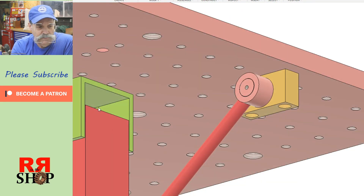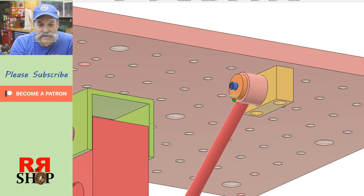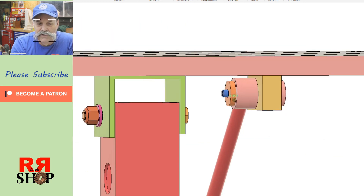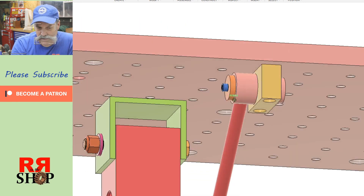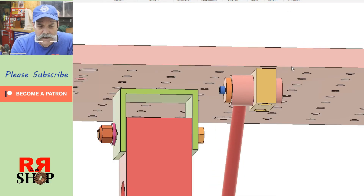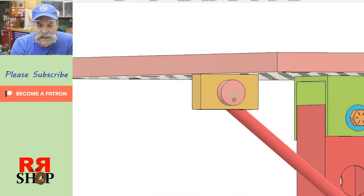Off camera — I'm not going to show making this — but this is just a washer with a quarter inch hole in it, and a socket head cap screw to hold that on. That would just stop this from slipping off the pin. I want a nice free fit here, no binding whatsoever. It has a little bit of wiggle room on the sides. If we make it too tight, too precision, things won't work. This part here, this movement, you want to have a little bit of play in there.